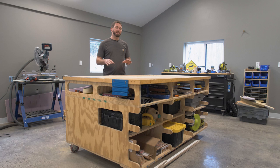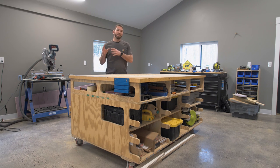So for the same dimensions of the top that I use, the 55 by 17 inches deep, 3 50-pound bags of concrete is gonna create a top that's approximately 2 1/8 inch tall. So if you're adding a 3/4 inch bottom to your form, then your side walls are gonna need to be that 2 1/8 inch plus the 3/4 for the bottom.